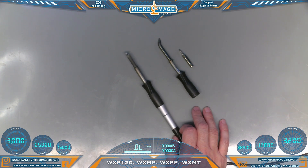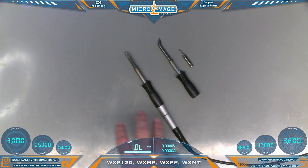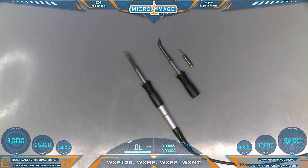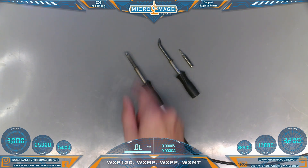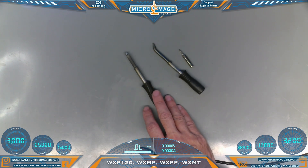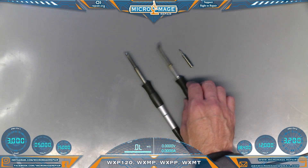As I said in the video for the base units, it does have temperature recovery. If you stick this on a ground plane or a thick board, it'll pour more power into the iron to recover the temperature and get you back to the temperature you have set. That is a professional feature — not a lot of irons had that feature when I went to make purchases.